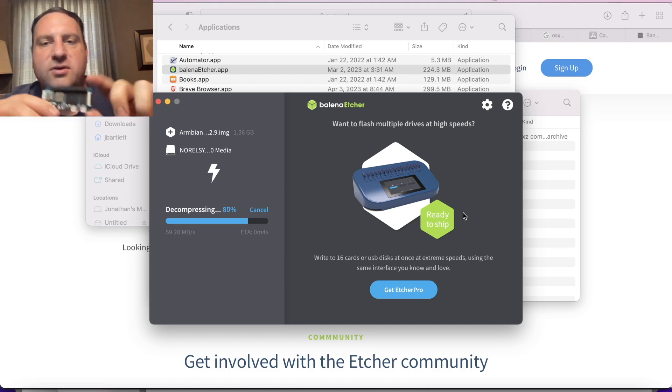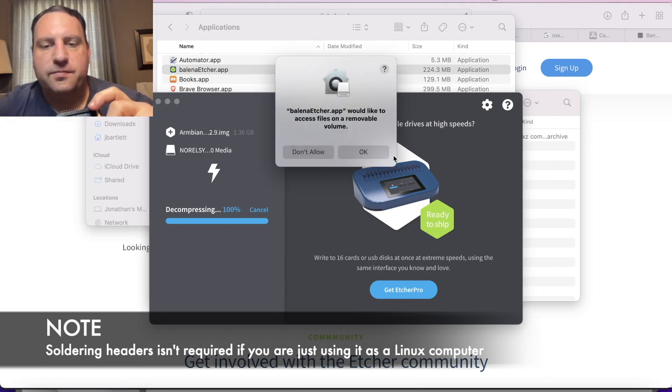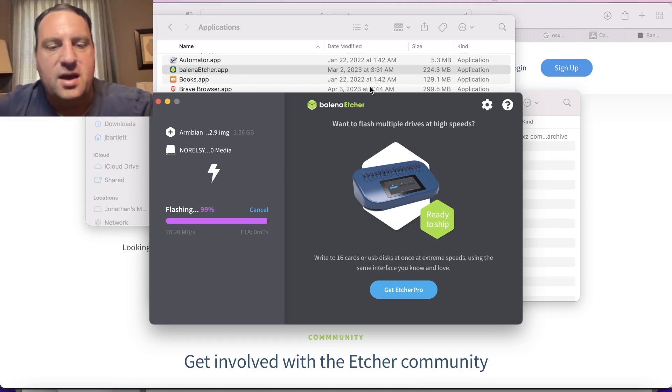One thing I did want to note while we're flashing: I did have to solder the headers onto this myself. So if you're not into soldering and you want to use GPIO, you do need to add the headers or find some other way to attach to the GPIO. But soldering headers isn't hard — it took me about five minutes. And soldering headers is also pretty error-proof. I am terrible at soldering, and these are pretty resistant to bumbling around. You just have to take a little bit of care — these are hand-soldered by me.